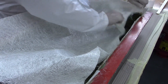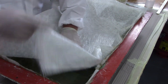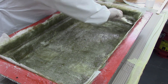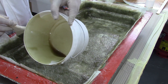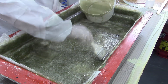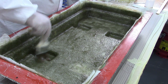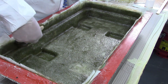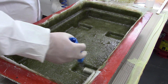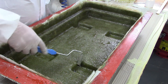Repeat these steps for all your layers of fibreglass, ensuring all trapped air is removed and each layer is fully consolidated. As you can see, our calculations were quite accurate and we don't have much wastage at all in our bucket. However, results can vary between types of resins, application method and level of user's experience. If you do run out of resin, simply ensure all the fibreglass is consolidated with the rollers before mixing any more resin, as you do not want these layers to cure unconsolidated while you mix a new batch.